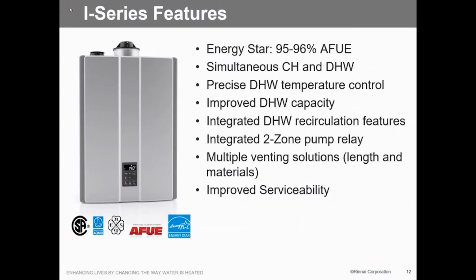So what we do is we actually have the thermistor built into the discharge up here. Because if you're doing a boiler and you're doing 185 degrees, that flue temperature is going to get a lot warmer than that. So we actually have this in here as a protection. So we can probably duty cycle the burner if we wanted to, or if we're going to use a different venting, like stainless or poly, then we can bypass that so it doesn't cycle. So we have that built into the unit. We can either do stainless, poly, or we can do PVC.